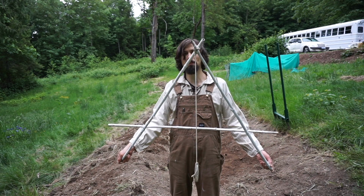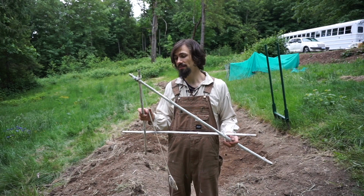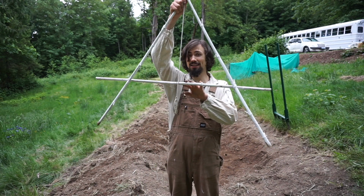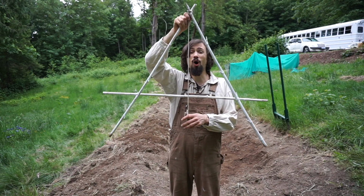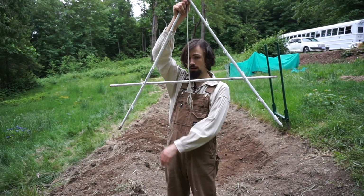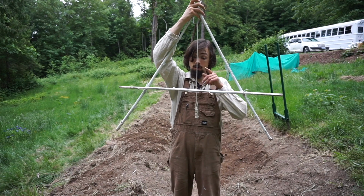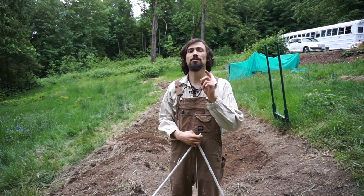Now you might be like, but Matt, how do I figure out? I can get sticks, doesn't matter the stick size. They don't have to be exactly the same size to find flat. If you think about that, that makes sense, right? It doesn't have to be flat here either. It can be crooked. To find flat is flat. You put it on still water and you can find it and mark it. It's easy. Or you can mark the feet on the ground, take a line, flip it, put them exactly to where those marks were, mark it again, and exactly between those two marks is flat.